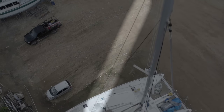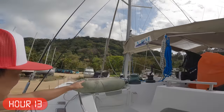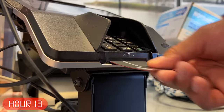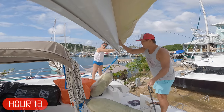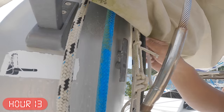Like how to replace this line we completely forgot about. Do you see that black line at the end of the boom that goes all the way to the top, comes all the way down the mast, and ends up right here? This line is the topping lift. We needed to replace it with a new topping lift we got in the US. We had enough line. I was looking confused because I couldn't figure out why the boom was stuck — turns out I forgot to loosen the lazy jack lines that hold the sail bag up, which was holding the boom up. Once they were loose, we dropped the boom onto a fender.